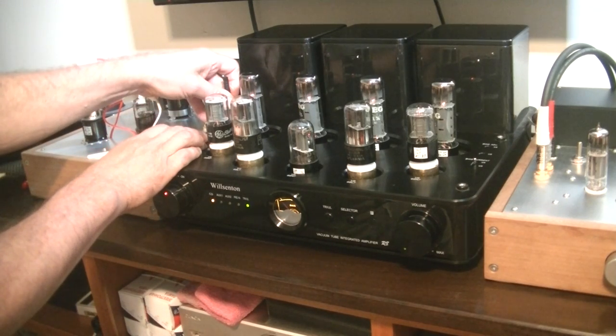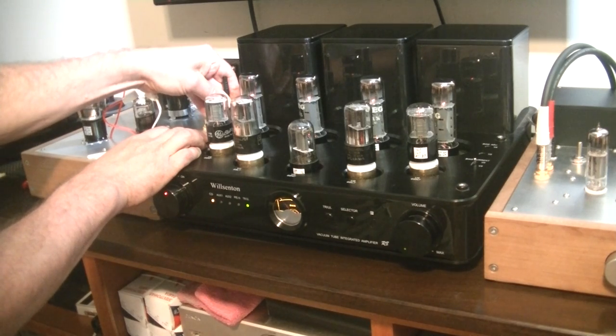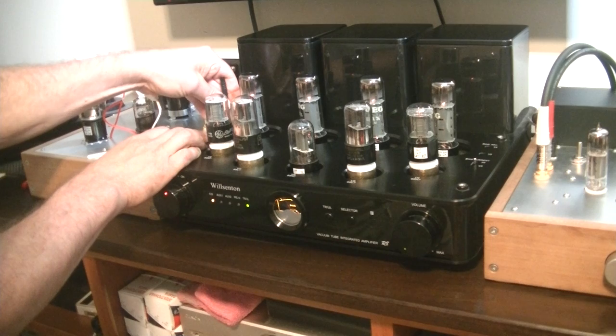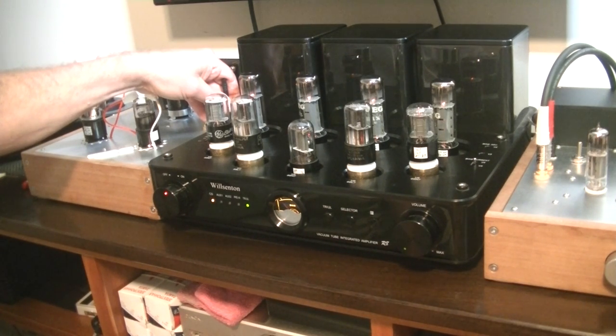We're on V2 now, pushing the switch over to V2. Some amps just have a little plug-in for a voltmeter — most likely you set it to millivolts, and your manual will tell you the spec you're biasing to. The screws and plugs are normally at the rear. Follow your manual's instructions, but if the manual doesn't tell you to zero out your bias, bring it down anyway. Make sure you know which way to turn the screw to zero the bias, because the bias pots could have been wired in backwards.